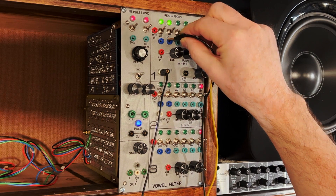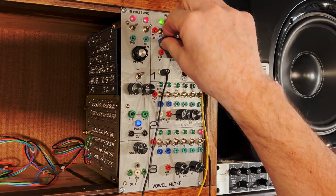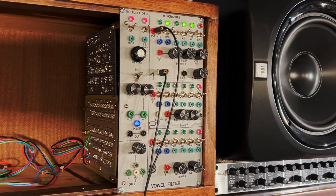I can drive these capacitor switches with signals from my synthesizer. I can add gates from processes going on in sequencers and clocks and just have it develop its own rhythm. I can also apply control voltage to a MOSFET across the whole stage and sweep it to more or less adjust the cutoff frequency smoothly. It does introduce its own distortion, but that's part of the fun.